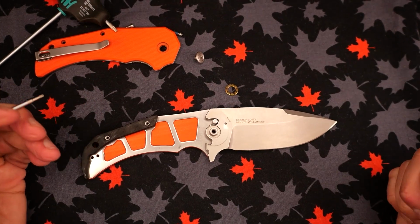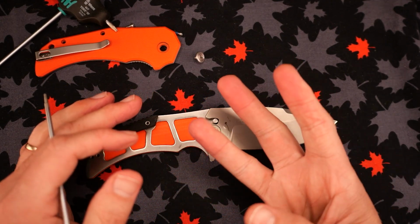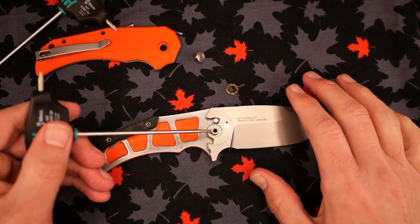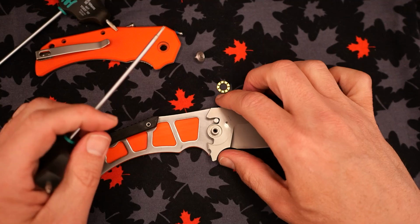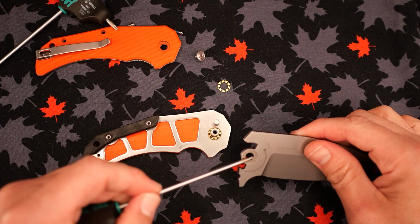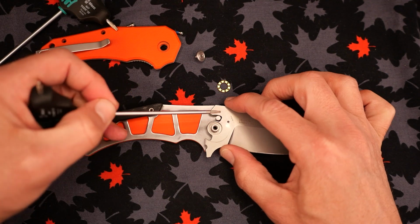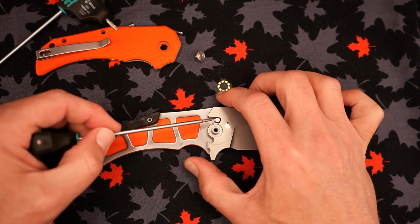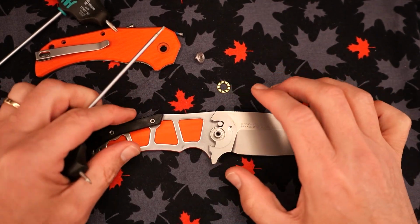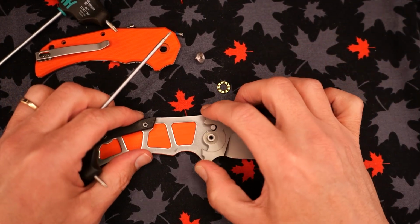All knife locks, all folding knife locks, have to put pressure at 3 points in order to hold the lock steady. One of those points is where the pivot pin meets the blade. And we do have a chunky, thick piece of steel, so it meets right there on the blade. And on the stop pin, where the stop pin meets the blade, and where the liner lock meets the blade, all three of those points work in concert to hold it steady. If those are just a little bit off, that's when you get lock rock and blade play. That's not a good thing.